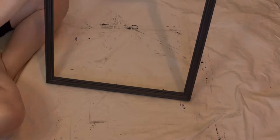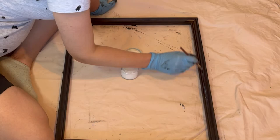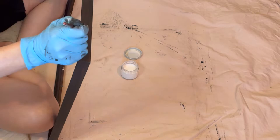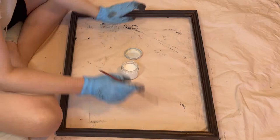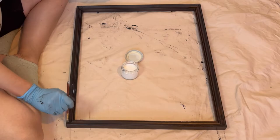After applying the two coats of paint, dust off the surface before beginning the polyurethane, and be generous with the drying time — make sure paint is completely dry before that first coat. For this portion of the project, I'm wearing a respirator. Polyurethane contains toxins known as isocyanates, which are very bad for our health and can lead to asthma and other breathing problems. I've also read that fumes like this can lead to cancer, so it's better to be safe — especially if you're pregnant and doing this craft, as I am.